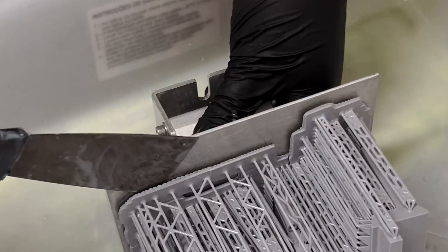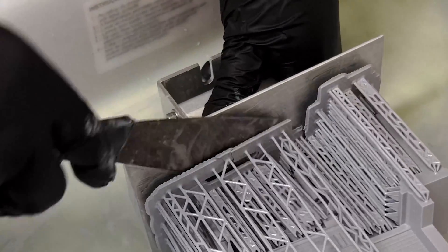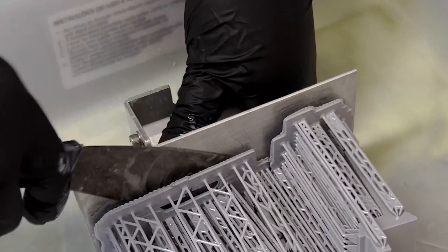It's as simple as it sounds, however it's a crucial step for the success of any printing. If the process is done correctly from the beginning, it's possible to do it only once, and if you're lucky, never again. It's obvious that the build plate can become misaligned someday, but this should only happen if when removing pieces from the platform you end up forcing the adjustment of the screws a lot, since we're talking about thousandths of a millimeter.